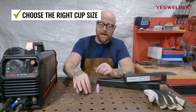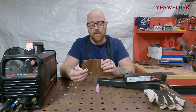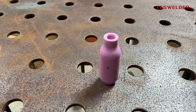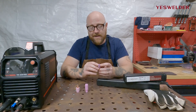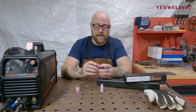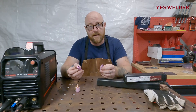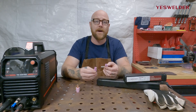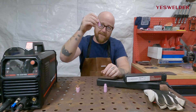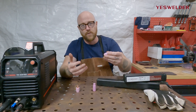Choosing the right cup size: the cup is the piece that goes on the end of the TIG torch with the opening, and it dictates how the gas flows out of your torch. To get a good weld, choosing the right cup is vital. This right here is a size 4 — the opening for gas is really narrow. A narrower cup tends to produce more turbulent gas flow. Here's a size 5, a little bigger and more open, so gas flows better. The trade-off is that if you go too big you waste excess gas, and you also have to consider the weld joint — a bigger cup won't fit down into a T-joint as well as a smaller cup.